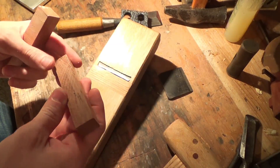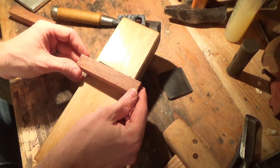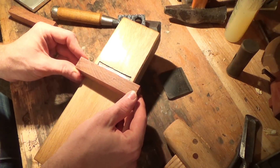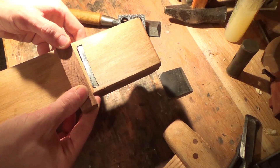And a few little pieces of Jatoba — this is a Brazilian cherry and it is extremely hard. What we're going to do with that is actually inlay that into the mouth there to kind of widen that gap a little bit, but also to give that some good bearing surface.